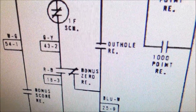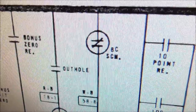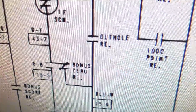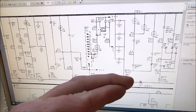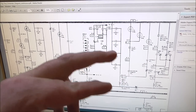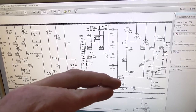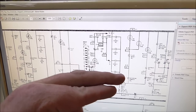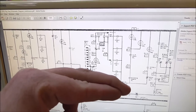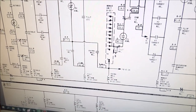So what was happening was this switch was adjusted really far out. It was touching, but just barely. So this was opening up almost immediately whenever the power died. Whenever this opened, this would almost immediately open because it's a physical thing. So the relay pulls in and moves the switch a little bit, right? If it's real far apart and it's just barely touching, as soon as power drops to the relay, it starts moving back open, and so it immediately loses power. But if they're adjusted really close to where as soon as it pulls in, they're close, then whenever it drops power, it's still connected until just the last second. So that's what was going on.